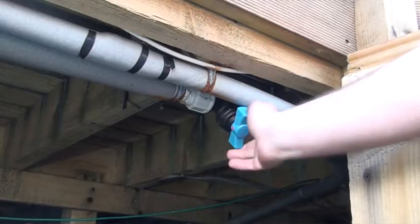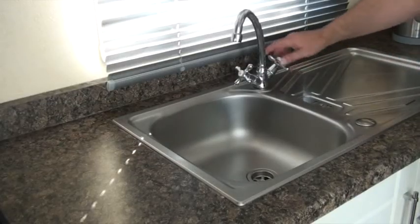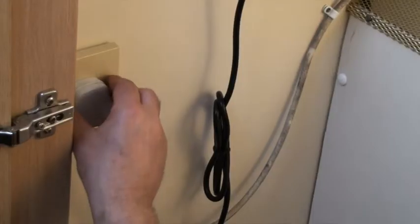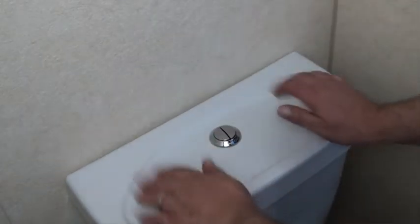So I'll just turn off the water here, and then we'll make sure that all open outlets inside and out are closed. We've made sure that the mains water stopcock and all taps or faucets have been turned off, and very importantly that the boiler is unplugged and that the toilets have not been flushed. This all makes sure that the system is airtight.